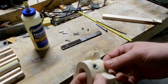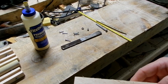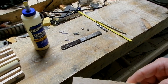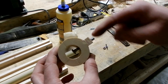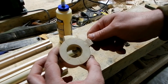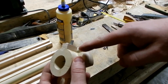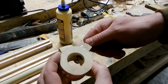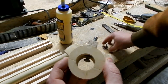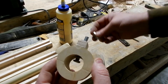Apparently wood glue does not hold in end grain very well. So I'm just going to make a little cap piece to screw over top of this. I have my carriage bolt, which I've ground into a round shape, and I've fed it through the back side here. The nut is now trapped inside these two pieces of wood — this is screwed and glued down. So now we just have to add our wing nut and stop nut to the other end.